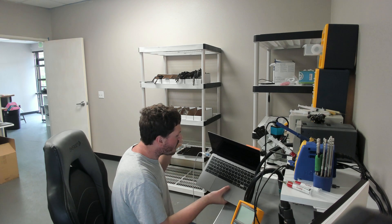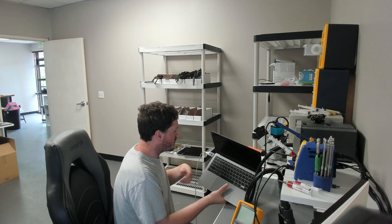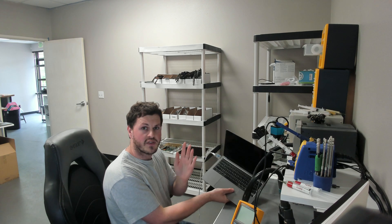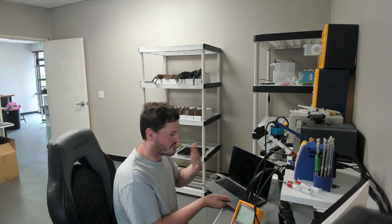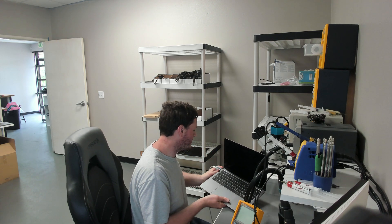There is some communication going on with the CD3217s — that's a good sign at least. Same thing on the other port, exact same reading. So at this point, if I had the exact same readings on two ports, an issue with one of the USB-C controllers is less likely, and something further up — T2, PMIC — something along those lines is more likely.